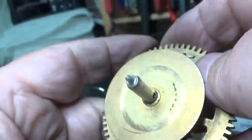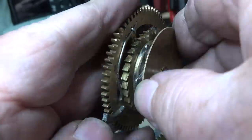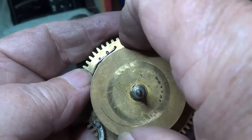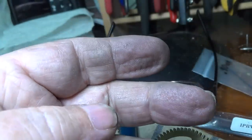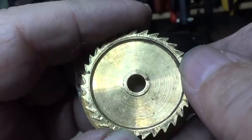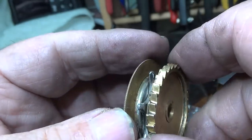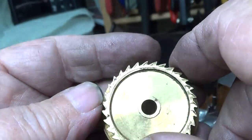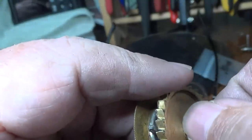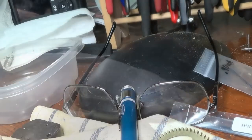the wheel, it's not going to be flopping around like this. I mean, look at how bad that is. All right, so we're going to have to take that apart. And the way I do that, I've already done it to the wheel I'm going to be working on, is I reverse the jaws in my three-jawed chuck, put this into the lathe, and then I just turn off this piece that's sticking out here. Just cut that right off. Okay.